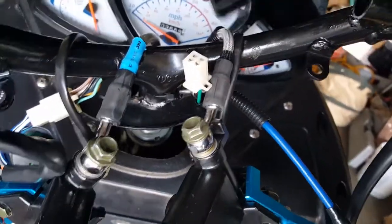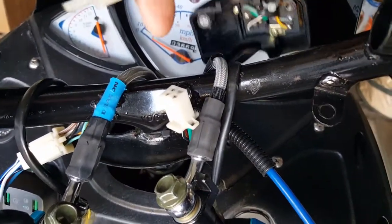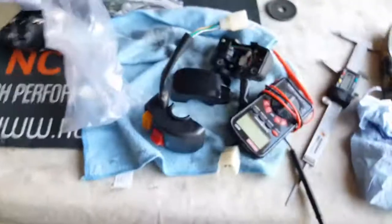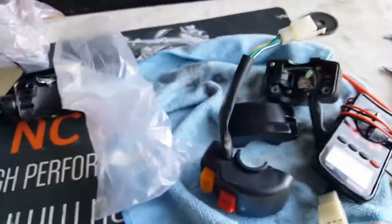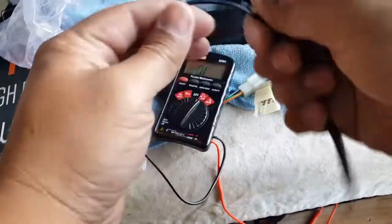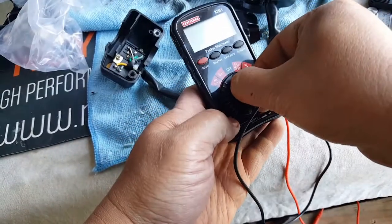You remember how we had the continuity — so this guy and this guy here are both ground, the green wire is ground. Let me make sure — all the grounds are tied together and brought in. So if this green wire is on the left side right here — facing inward — we can see the green wire ground is on the right-hand side just like we anticipated. What they did was they probably tied all these guys together being ground so they wouldn't have to use a fourth wire, versus the other one which uses a six-prong so they want to make sure they're all independent ground. Continuity is just checking to make sure the wire has the same continuity because it's connected — checking if there was ever a break in the line.